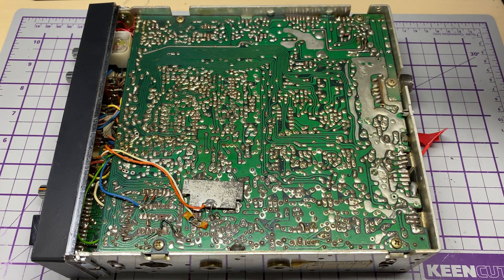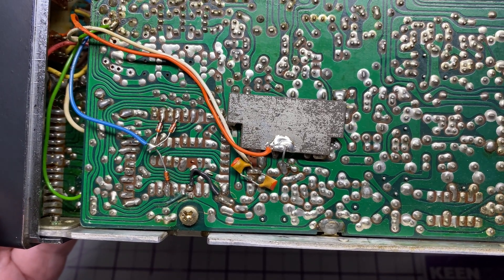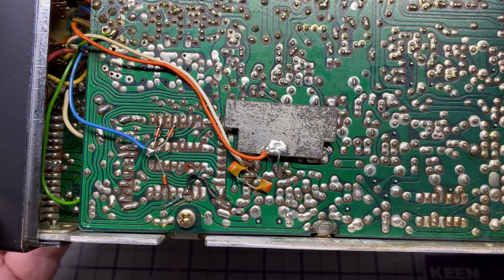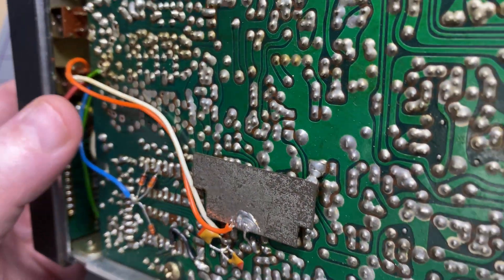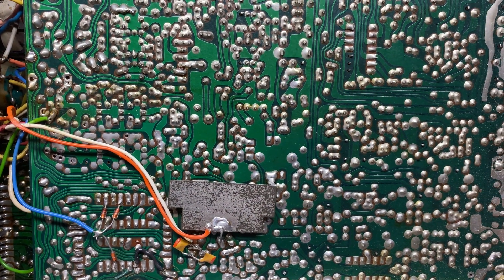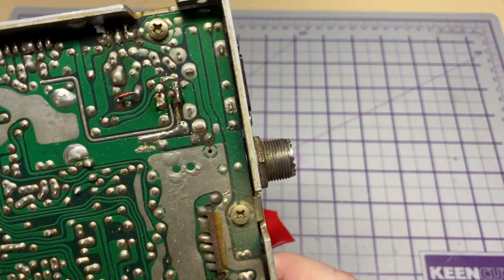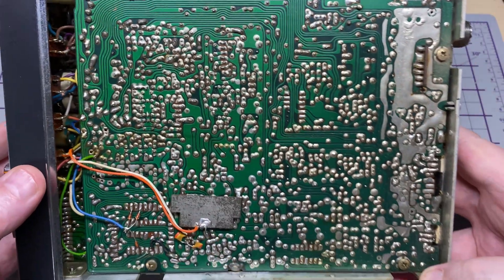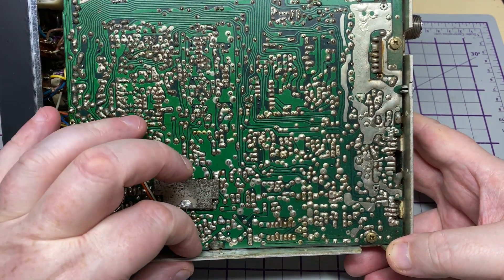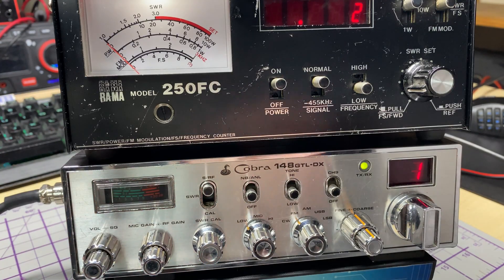Taking off the circuit board side, there are obviously some modifications: there's some diodes on the adders, something on the back of the PLL, and a wire connecting to the 5KC pin which goes off to the channel 9 switch. I'm not sure how they've implemented that when there's no cut tracks. Having a look around, there's a little bit of a burn mark at that point in the top - we'll have to have a look at that. But apart from that, everything seems to be okay.